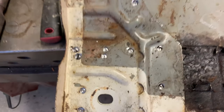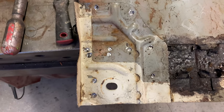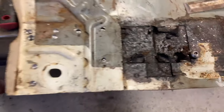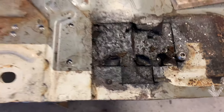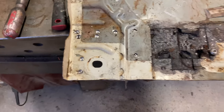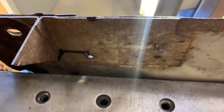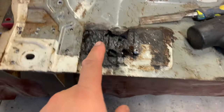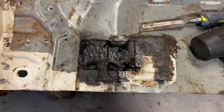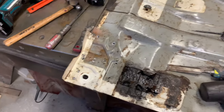If you're curious, these are the spot weld points you'd want to drill out to get this plate off. My reason is because of that bit of cancer there. There's another plate on the underside that will also have to come off, so I'll unstitch that, sandblast it, weld in fresh steel where needed, and then stitch it all back on.